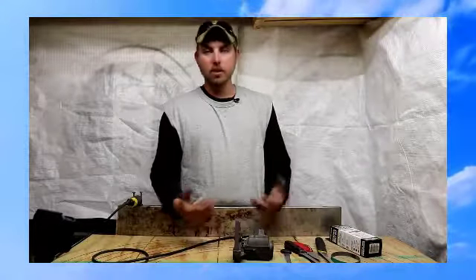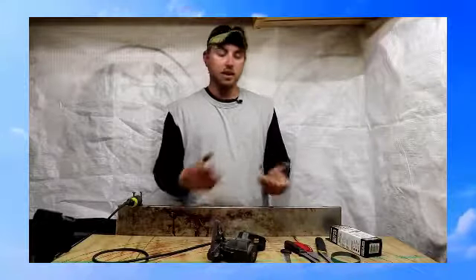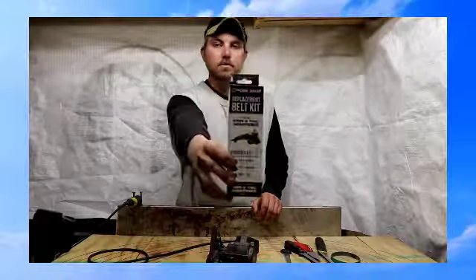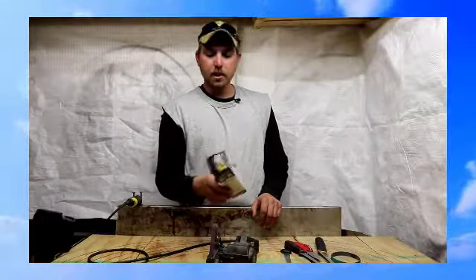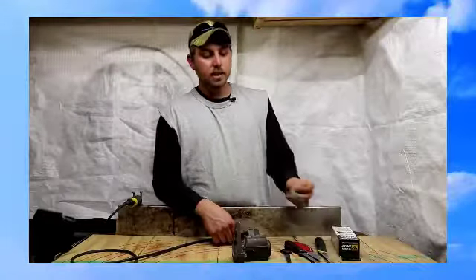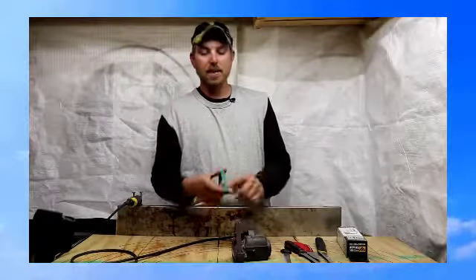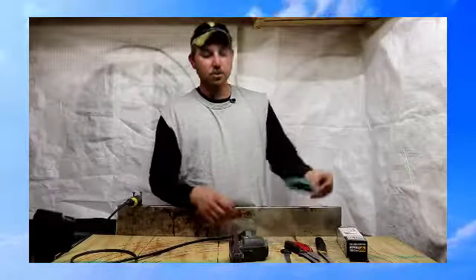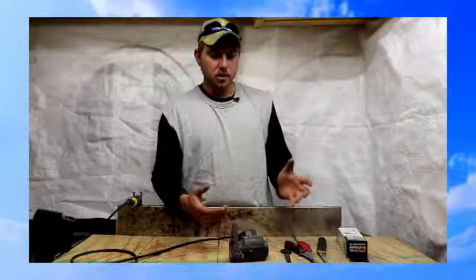You can look at that as a good thing or a bad thing. Personally, it's not that big of a deal to me — if I want to sharpen a good quality knife, I'll sit down with a stone. But for quick and easy, this thing is just awesome. These are the replacement belts you can get — they're the WorkSharp brand, and they run about eight or nine bucks, so they're not that expensive. These belts, if you work them right, last a long time. I've even taken the coarse 80-grit belt and worn it down to more like a 220 grit and just used it on through, because the way I use this sharpener for touching up skinning knives, it's really a good tool.